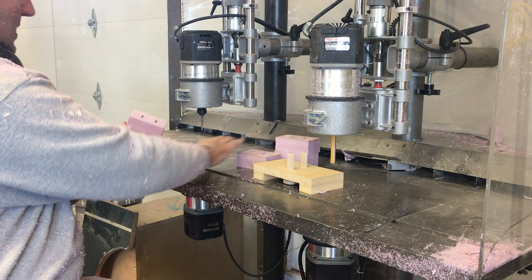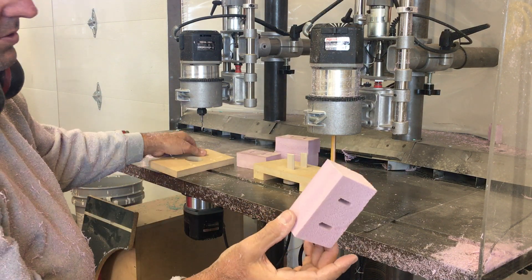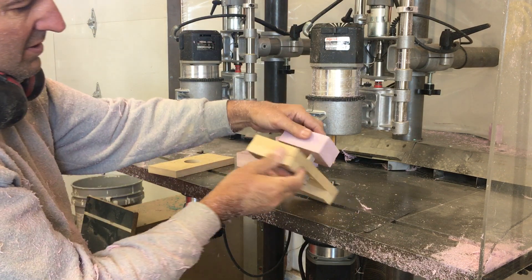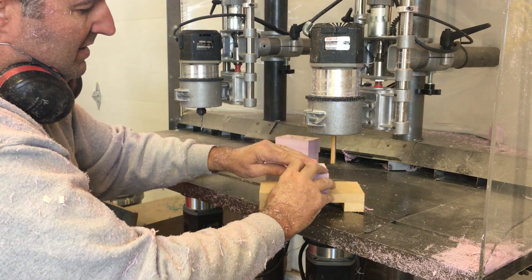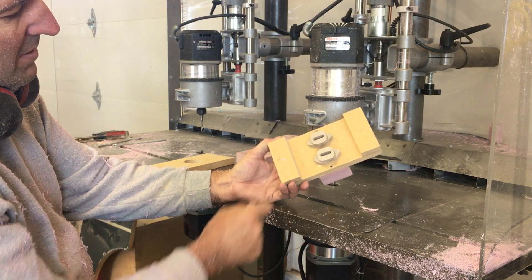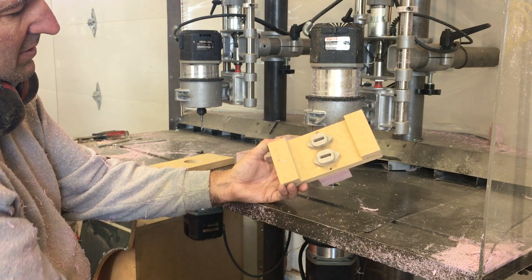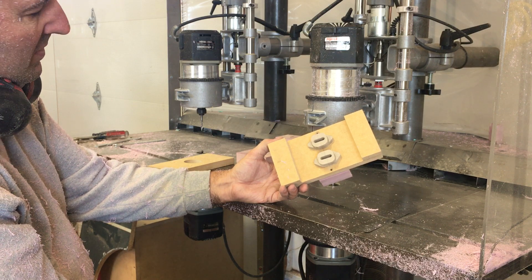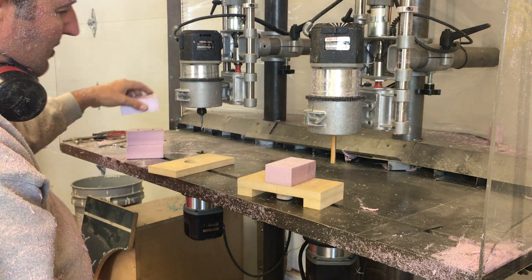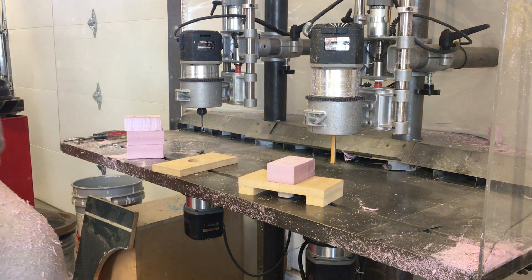I attached it to my setup board, got a quarter-inch bit and a quarter-inch pin, and just routed those little grooves in there. They sit very nicely — just plug right onto this fixture that's got a couple of tangs on it. Underneath is the intake port and exhaust port pattern; the step in there is for the flange, and then this is the tunnel that penetrates the cylinder wall. Two cutting passes to do this: one to cut the tunnel and one to cut the flange.